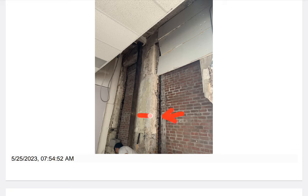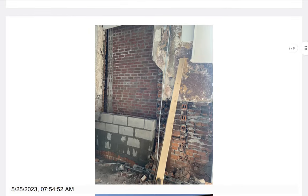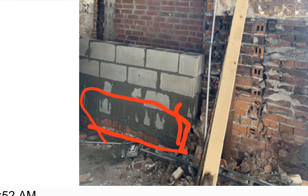Now it brings us to May 25th, 2023. The engineer stated that specific blocks in that wall system should be grouted with number-five rebar added, and dowels tying to the existing wall. Think of it as a column system — there's your column system for the wall, and here's the steel. Part of the wall separation is visible here with a gap. Is that shoddy craftsmanship, or is that the grout that ran over the face when he poured it inside the block? The second block may not have been grouted yet — you can see it bleeding through.